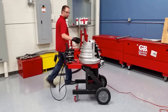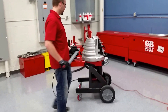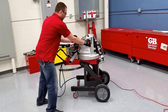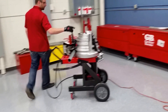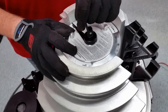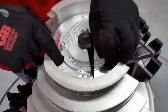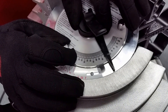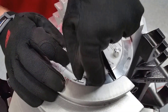Now we're on the EMT side. I'm going to go ahead and insert the conduit first — just another 90-degree bend. That's lock number one, lock number two. Now we have to work our limit switch control up here. We're looking for the 2-inch mark, so you take this red mark here and line it up with 2 inches. That's set. Then we take the dial and set it to 90 degrees, and once it's set, just lock it in place.